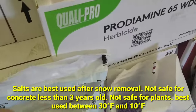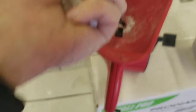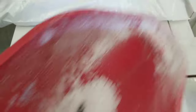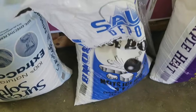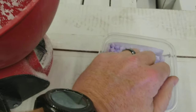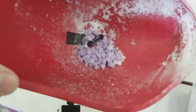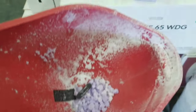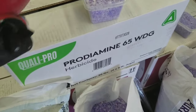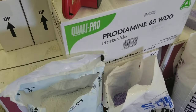About the only thing you really need to focus on with salt is whether it will fit inside your spreader. This one has a really nice granular that fits into a spreader and comes out easily. If you don't have a bigger device, this ice bomb has a dye on it — that's why it's purple — so you can see where you're applying it, which is nice. But you can see that in a handheld spreader it's going to get stuck. The difference between coarse and fine: coarse is going to provide traction for your feet and vehicles, so if you want something easier to drive on right off the bat, go with coarse.